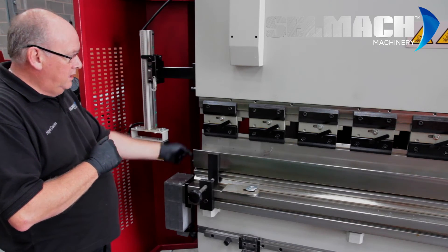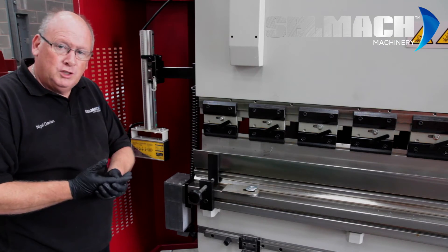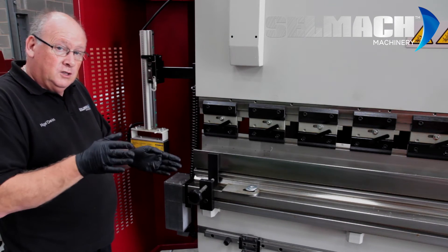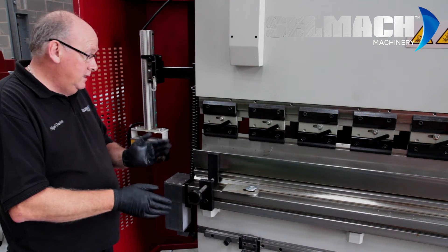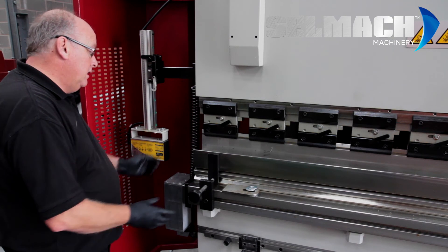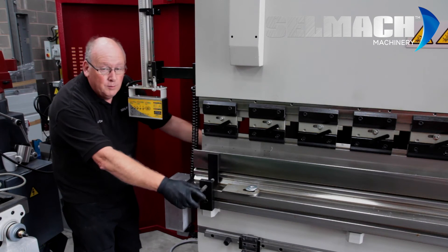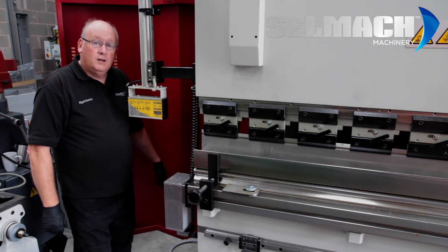You wrap a chain around here and here. Place the machine into slow speed and take it up. Obviously, you would have released all the handles first. Then turn the V to the correct V that you require, make sure it's all clean and the bed is clean, and in slow speed again bring the beam down, adjusting here and at the rear. Looking down the center of the machine, align front and rear at both ends, then nip the middle when finished. This is how to align a multi-V.